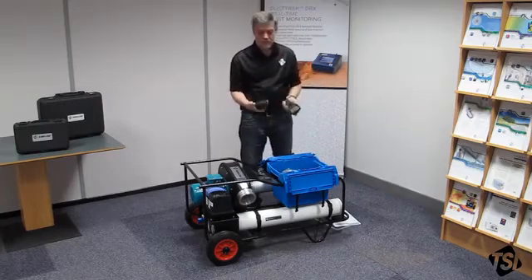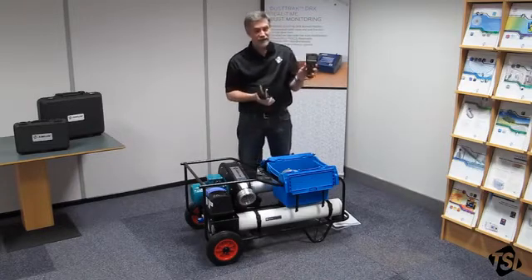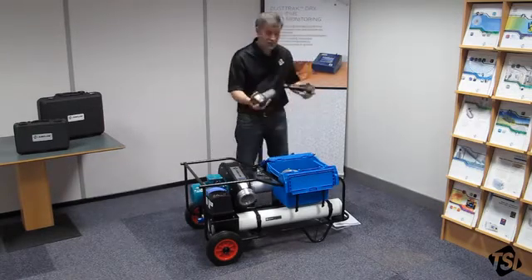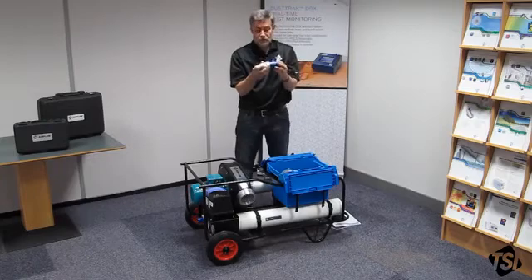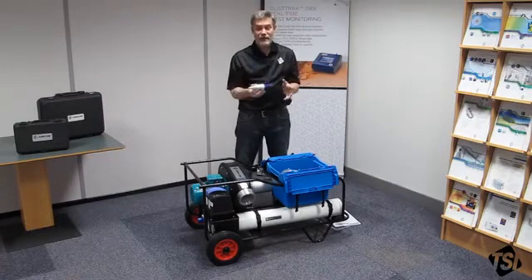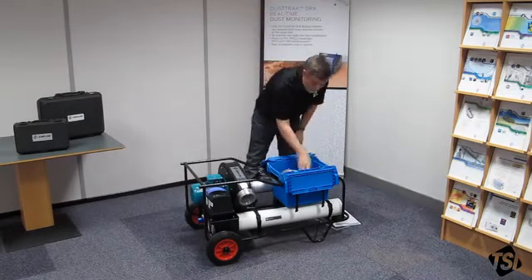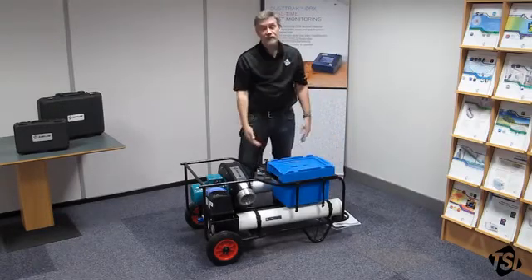Two instruments: this is your TA465P and this is the PDM610. The TA465P is for measuring the leakage rate and the PDM610 is to set up the static pressure. When they arrive they come in their own cases. Lastly, we have a 230 volt mains supply adapter. You can also get a 110 volt version but that's a separate Panda with a yellow socket — you can only use the 230 or the 110. It must be wired up by a qualified electrician.